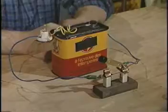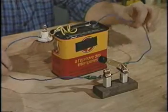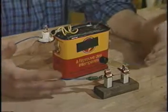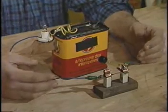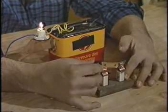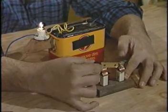This is a basic switch-and-bulb circuit. The word 'circuit' is the key to what's going on. The electrical current will flow through the light bulb only if there's a complete path from the battery to the bulb and back. It doesn't matter where in the circuit the switch is, as long as opening it interrupts the circuit.